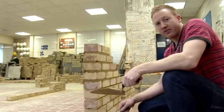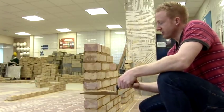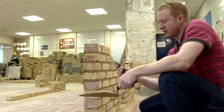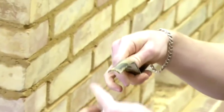Now we've filled the joints on the back of your wall, you now need to focus more attention on the front because everybody's going to see this — and this is called your face side. I'm basically going to show you the most common joint finish on brickwork or blockwork, which is using this tool here called a jointing bar. It's a half rounded joint — if you see the shape of it, it's rounded.